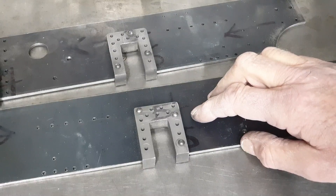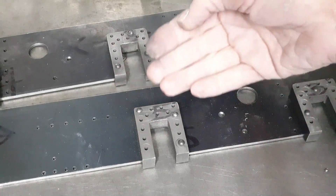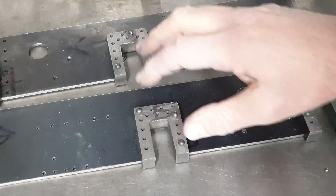The interesting thing about that note is it relates to a guard for the trailing axle, which fits around the horns and sits down over the inside face of the horns. Which is why these horns need to be riveted with countersunk rivets from the inside.